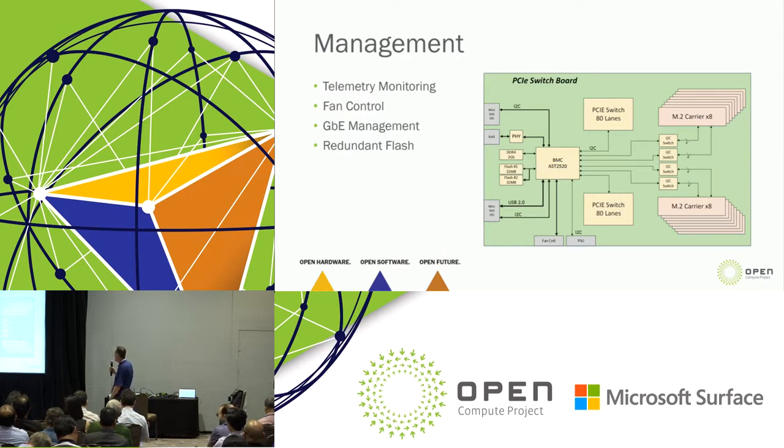The BMC is also responsible for the fan control. For Mount Olympus, fans are N+2. We like N+2. It keeps people out of the hot aisle and provides a certain level of reliability. We'll be working hard at the thermal solution to enable that: spin the fans as slow as humanly possible, and keep them alive as long as humanly possible. And the I2C is also accessible to the power supply so that we can do online updates of the power supply.